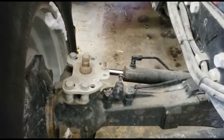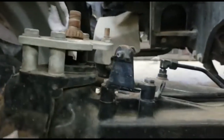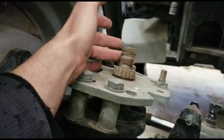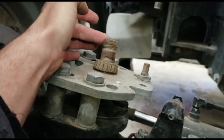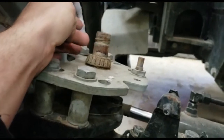Okay, here we are again. This is what we're working on. These plates here, they bolt onto the axle. There's four bolts holding them on. And then this bolt comes up through, which in my opinion is a major weakness in these fenders. It's a very, very fine thread. It doesn't hold worth beans. So if you get that fender caught on something, it strips that thread pretty quick.